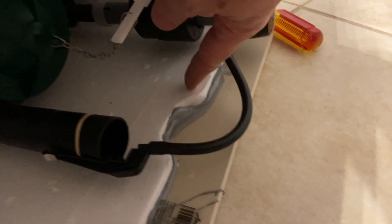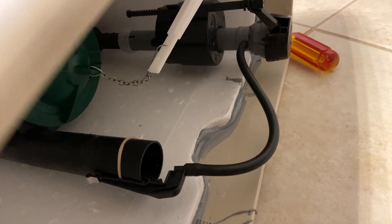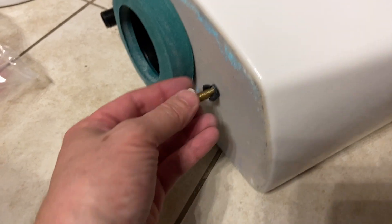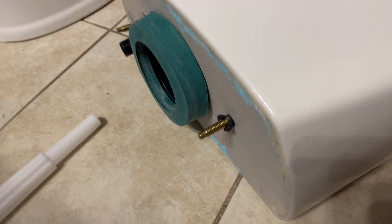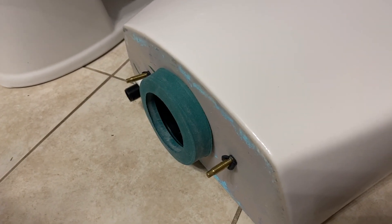I wanted to explain why we went with the Titan from American Standard. This has an insulated tank. We're in the northern climates up here in Minnesota, and we also have well water, which means our water temperature is generally around 50 degrees all year round coming into the house. If you have a time in the summer where the toilet's flushed two or three times in a row, the sweating on the tank will be pretty impressive. That's why we went with an insulated tank — this is the bathroom the children use a lot, so the toilet is getting flushed numerous times a day.